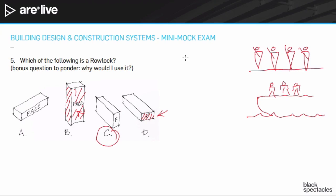All right, so what are the issues here? Well, one issue is when you are putting these things in a kiln, I've got them all lined up and stacked, a couple thousand of these things stacked together. These faces are the ones getting the nice heat that's really making them weather-resistant, at least sort of weather-resistant. Bricks are notoriously porous, but kind of weather-resistant. The faces that are not getting the same level of moisture resistance are these long, flat faces, so they tend to be much more porous. So the sailor course doesn't get used very much because you have the wrong face showing.